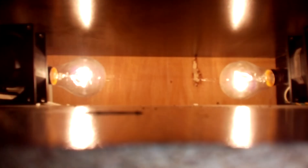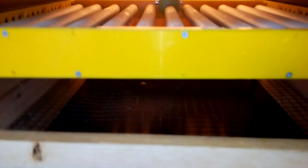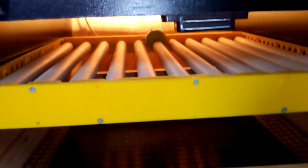I have two fans which are throwing air directly onto the heating elements, and the heat travels from the back side, down, and up through the incubator area. We have to put water trays in here — they will get warm, create good humidity, and the warm moist air will circulate upward, keeping the heat distribution even throughout the incubator.